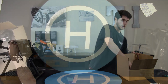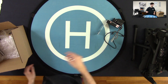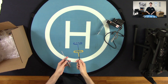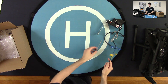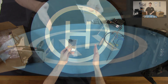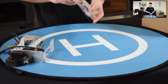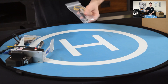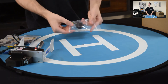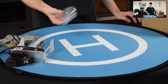First, let's take every component out of the box. We have the drop mechanism itself, we have our tools — a 2 millimeter, a 2.5 millimeter, and a 5/64 hex driver. We have the mounting plates that are going to go on the side of the aircraft. We have what we call the roof rack, which is a wire management system for the connection cable that goes into the top of the aircraft. And lastly, we have the strobe light cover, which is also a light sensor, and this is what's going to be used to actually activate and drop the payload.